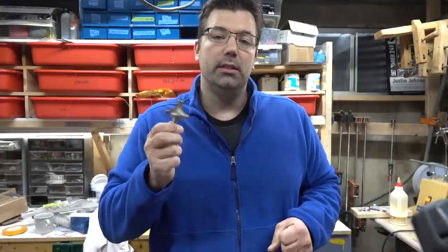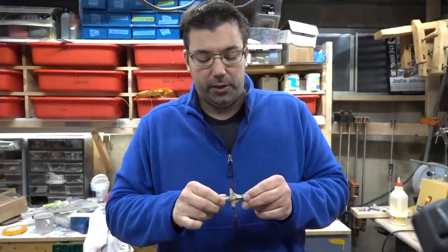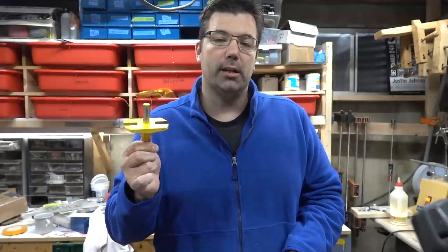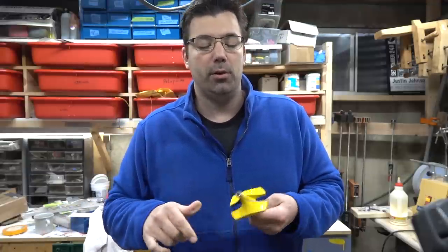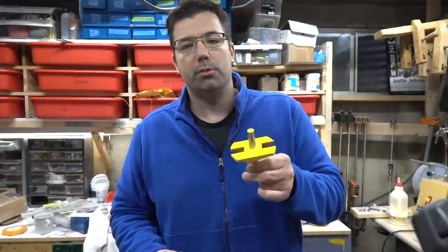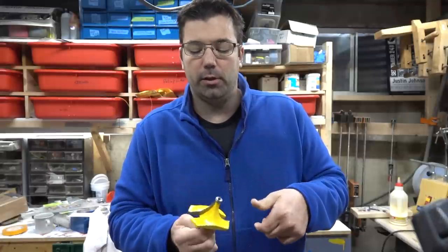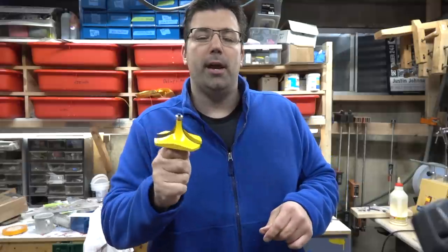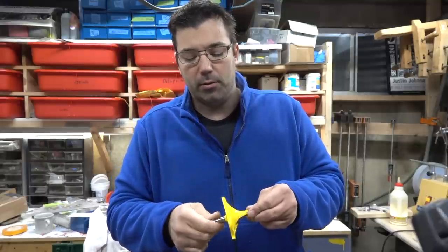Be careful when using these bits — they are very, very dangerous at high speeds. For the larger bits you've got to slow it down. Please look at the manual for the different speeds to slow your router down. Don't throw this bit into your router and turn it on at 22,000 RPMs — your router is going to shake and vibrate. Read the manual. Usually you slow these down significantly, which keeps it a lot more stable.